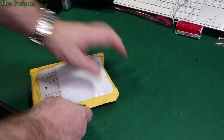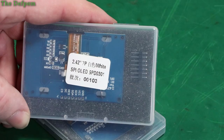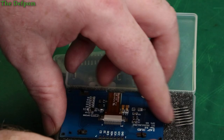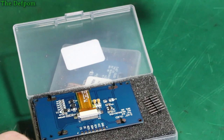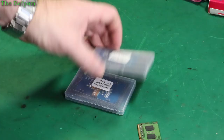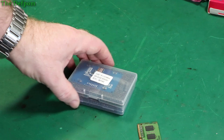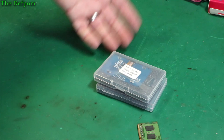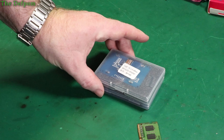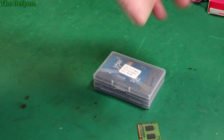You may have seen these before in previous mailbag videos — 2.42 inch 7-pin white SPI OLED displays. I've shown these before; just getting a few more and stocking up because I've quite liked them. Current-wise though, if you're on battery-powered projects they use quite a lot of power depending on how many pixels are lit up. I've seen in excess of 100mA running one of these on normal display stuff. I've also done a video on converting these from SPI to I2C, which is fairly easy to do if you know how.